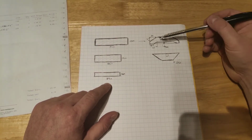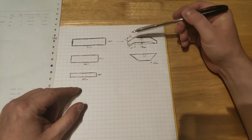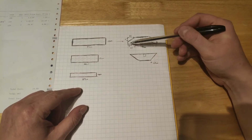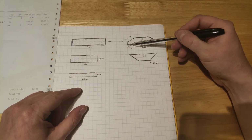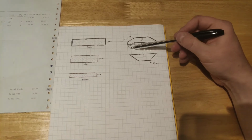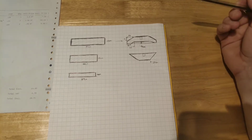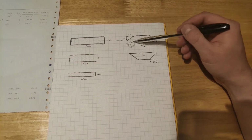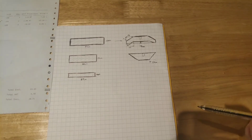These two guys here, then we're going to mark these up with some dimensions. So for this one here, there's a triangular cut that we have to make that's 9 centimeters by 24. There's another dimension here that we have to mark off in order to get rid of this waste here. So we come in 12 centimeters, we then come in 22, and then we come up 4 centimeters. We mark that off. Then we do the same dimensions on this side, mark that off again, and we draw our line in between here. And it's as simple as that. Some pretty simple stuff here.